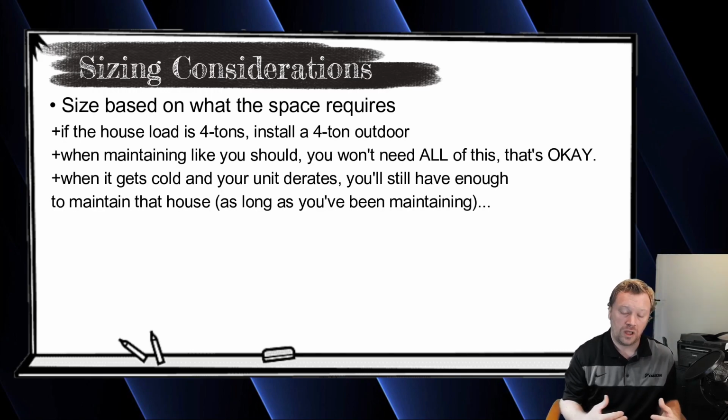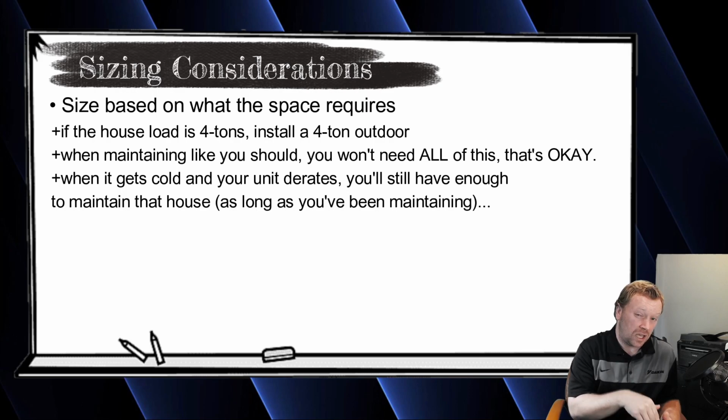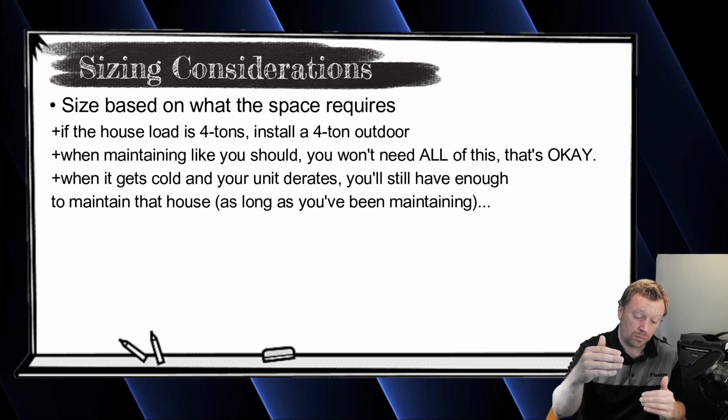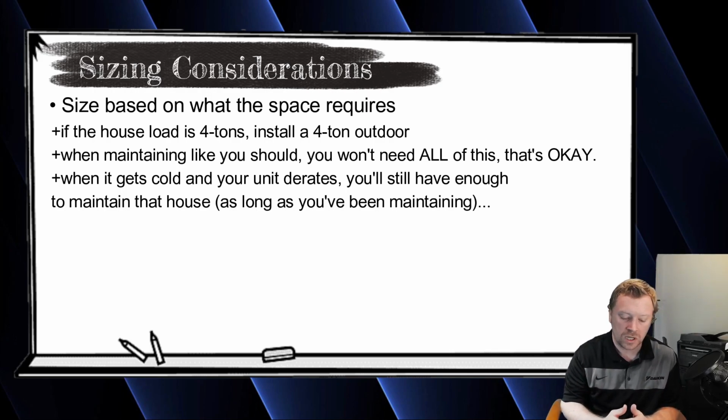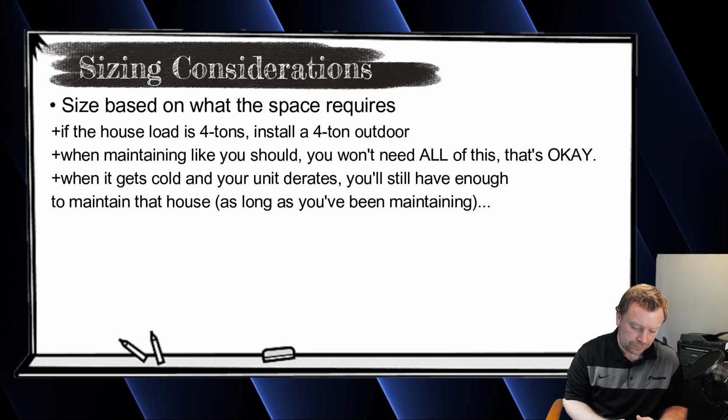That way you're covered. That way you're not going to be running into the problems by putting in a 3-ton outside. Technically speaking, on VRV systems, 4 tons, 48,000 BTUs is more than 130% to begin with. So you're already going outside of the design parameters and you're going to increase your risk for having problems. I don't recommend it. Okay, there is no need to try to downsize that outdoor unit.